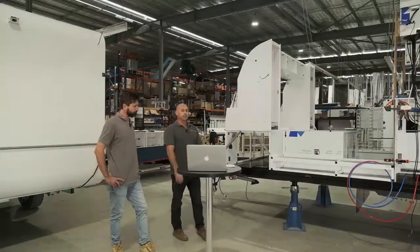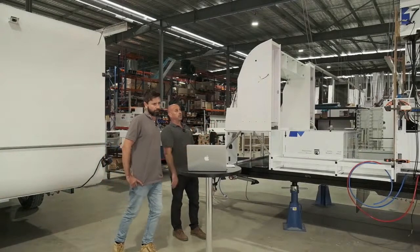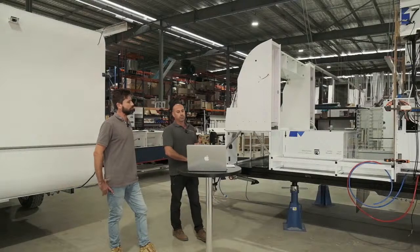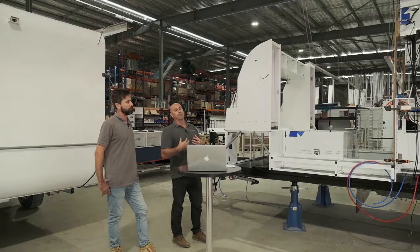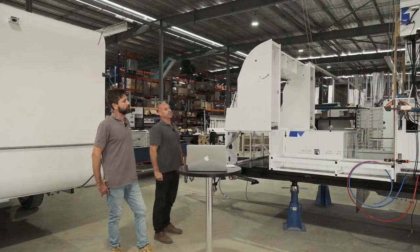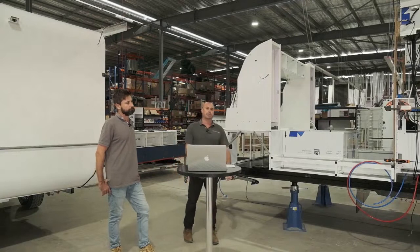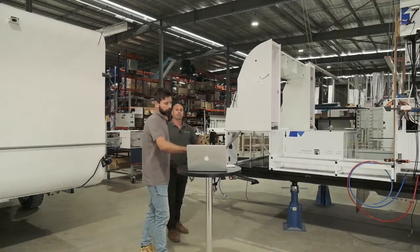So the bonding is key to our whole structure. But that's pretty well why we don't have frame walls, and we don't have any rot. If there's any water leaks, the only way one of our vans leaks is a hole that we'd physically put in ourselves. So that's the whole structure to our vans, because of a monocoque construction tied into the chassis, like Dave explained before. That makes the difference to how we build our structure of vans.